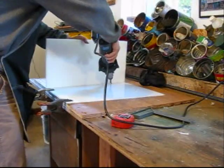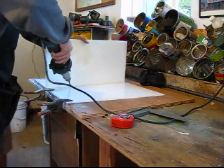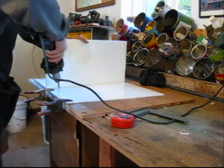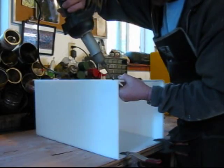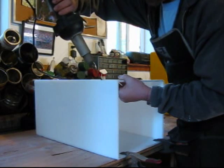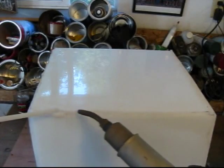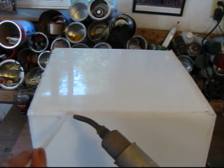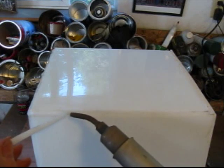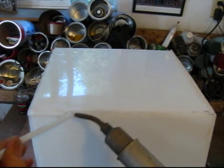I am now putting the motor cover together. Tack the entire unit together — this will hold the cover square for welding. For the motor cover, I cut thin strips from my quarter-inch plastic sheeting, which makes a good filler rod. I am also using all the heat that my air welder will produce. There will also be some downward pressure on the welding rod, so it will be best to clamp the piece being welded so it doesn't move around.